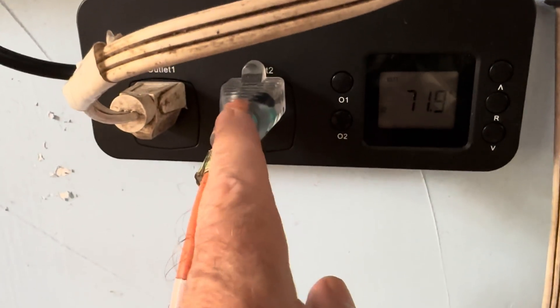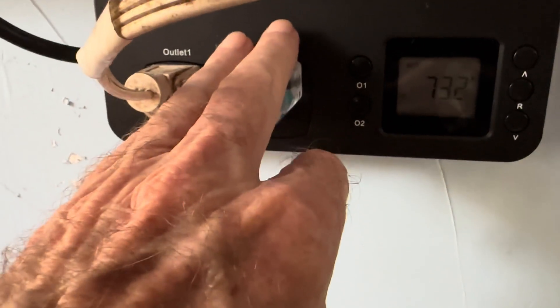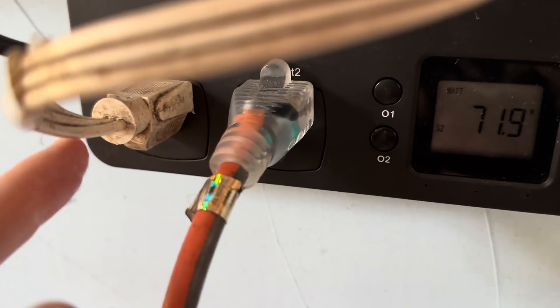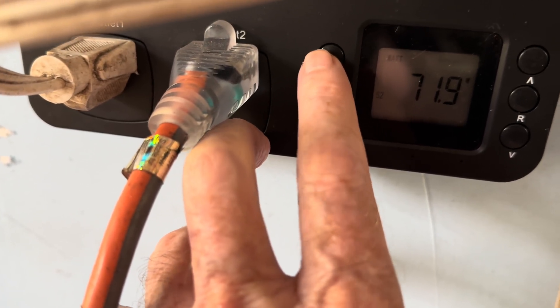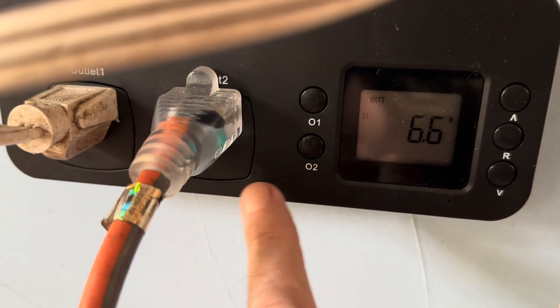It's plugged into power here already, so you just plug your device into here and toggle back and forth between outlet 1 or 2 to see what it's drawing. Outlet number 1 is drawing nothing. Outlet number 2, which has a freezer hooked up to it right now, is drawing 71 to 73 watts — which that battery of that size will easily run, just as an example. The wattmeter takes the guesswork out of what you're trying to run. That two-outlet wattmeter was only about 20-ish dollars, maybe not even that much. Turn on your light — the light is drawing 6 to 7 watts. That's it. I have a low-wattage LED bulb in there, so you can run a lot of those off a battery.